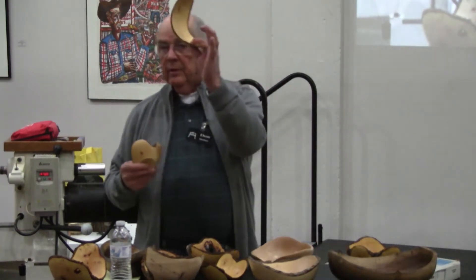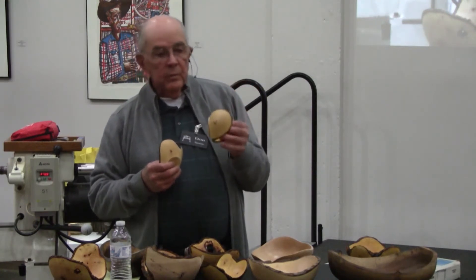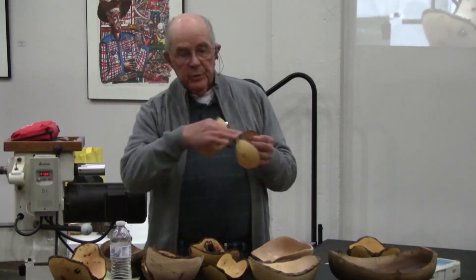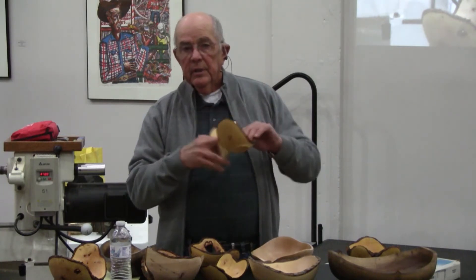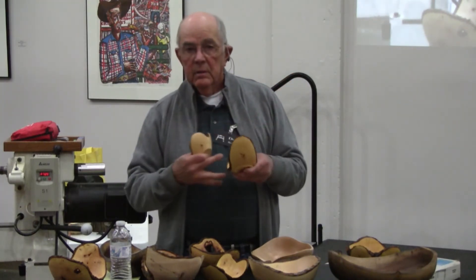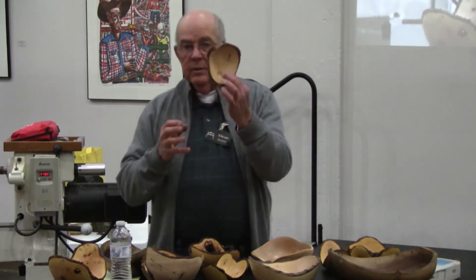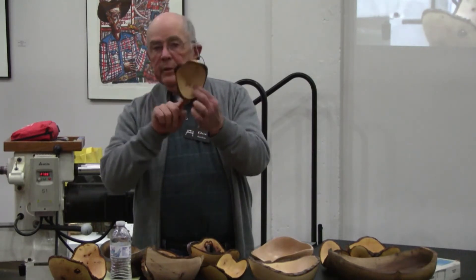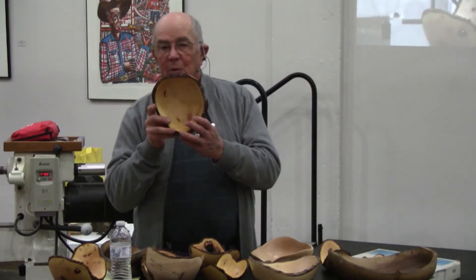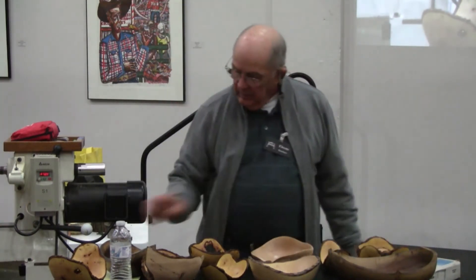When I finish shaping the outside, I put the super glue on the outside portion of the bark. Then when I turn it around and cut the inside out, when I finish the inside, then I do it on the inside — you have to do it that way or you'll cut it away. This is a crotch, and it's got three points. And here's one Barry turned also — it's got four. So will it crack? We don't know. It's the same thing with bark, and I'm kind of getting ahead of myself.